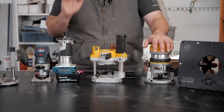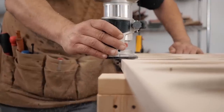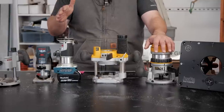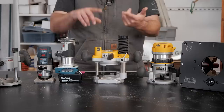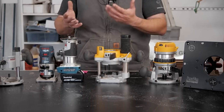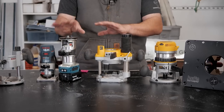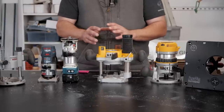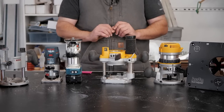Buying a bigger router won't always replace a palm router, and you can't use a palm router for some things a bigger router can do. A palm router is great for edge work, round overs, chamfers, and if you take small bites, you can get away with doing dados and rabbets. A larger router can flatten slabs, do dados, rabbets, and edge work — almost all the things a palm router can do. A palm router is a great luxury because it's very simple, fits in the palm of your hand, and is easy for light work. The key difference is that a palm router only comes with a quarter inch collet, whereas a larger router comes with both a quarter inch and a half inch collet.